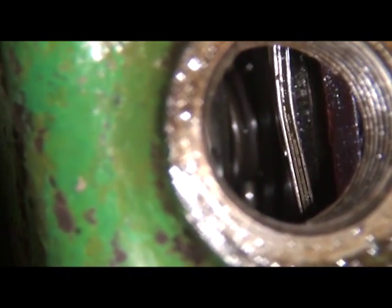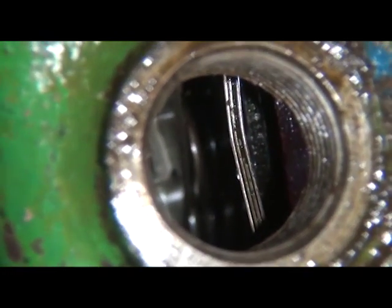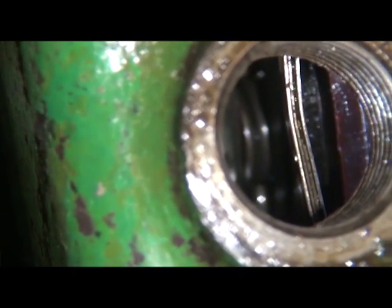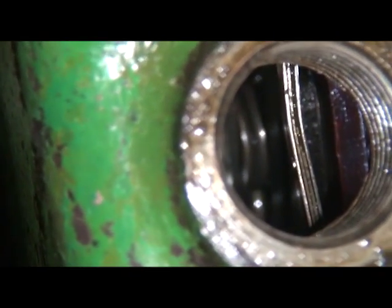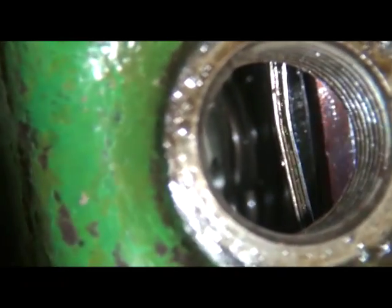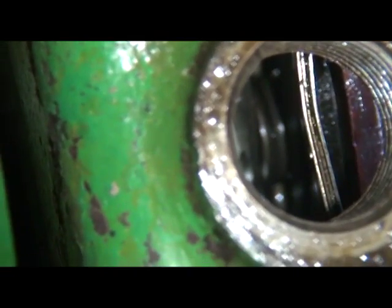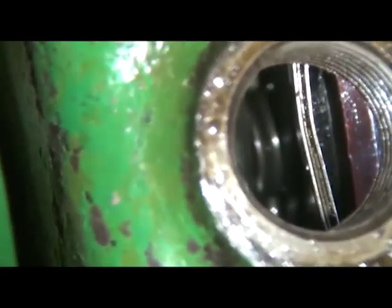And you notice that plate, that sort of dark plate, which is the clutch cam itself, sort of moved away from the brake plate. What we're going to try to do is stick the wire in between there when the clutch is engaged versus disengaged. On this model it should be 90 thousandths of an inch. And then on the earlier models, as previously stated, with the clutch adjusting cam that's got the tang washer instead of the locking screw, it uses 60 thousandths of an inch. So we're going to adjust that. We've actually done this, and we don't have enough clearance there, meaning the clutch is not tight enough. So we're going to have to tighten up the clutch.